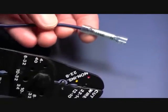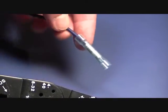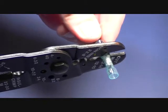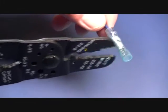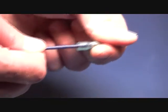Now the next step is to choose the proper crimp location on your tool — in this case it's right in here where it says 22 to 14 gauge. The blue is 14 and 16 so it fits right in that range. So let's do a nice solid crimp with the compression style crimper. Once the crimp is complete you'll notice that it has a curvature like a half moon on each side, and that's really what you're looking for. To make sure, you want to do a strength test — kind of pull to make sure that it's a good tight fit and it doesn't slip out of your connector.